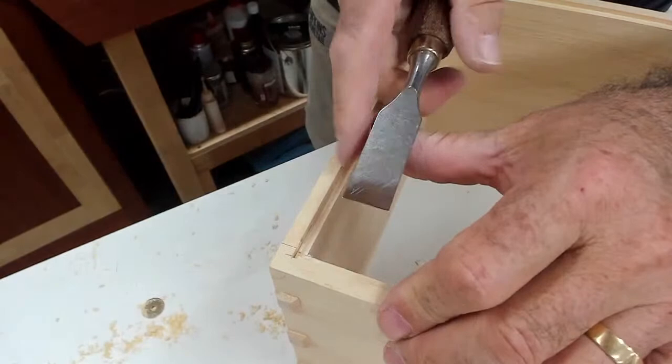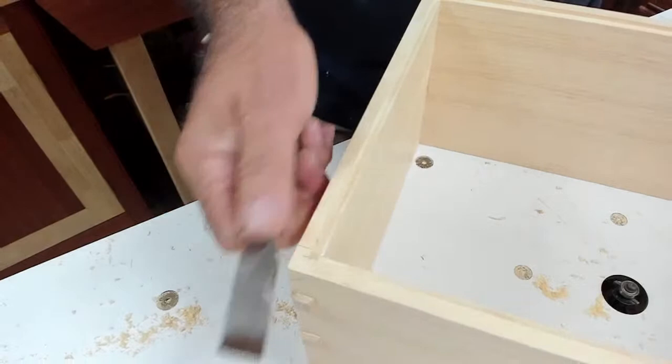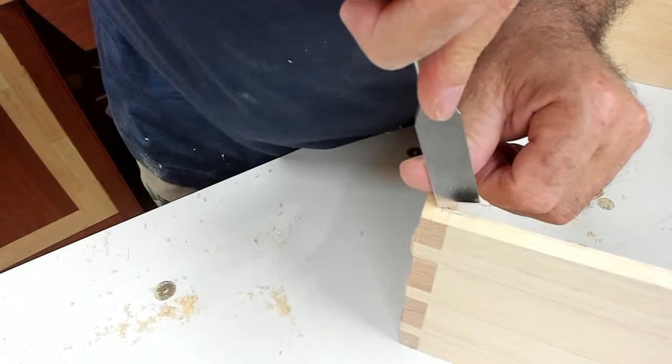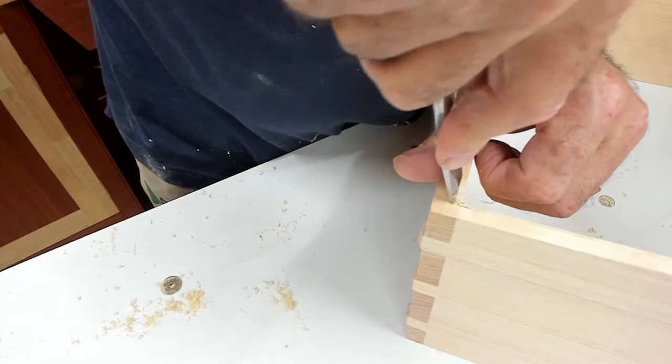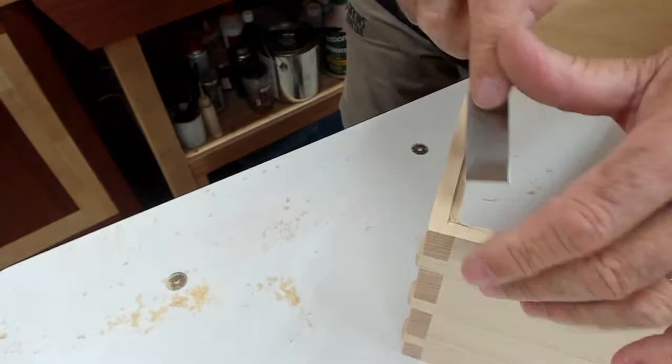And it's one corner turned up. Always cut across your grain first, so wherever you're cutting across grain. If you're cutting along the grain as well, do your cross grain first, and that way you don't split the timber. Keep your fingers behind the blade.